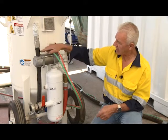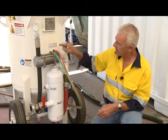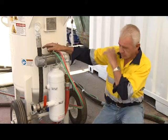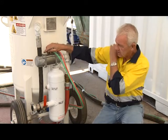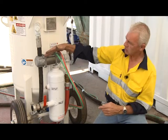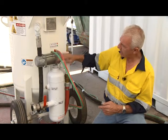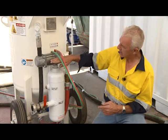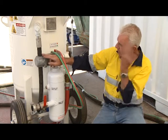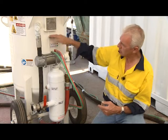There's a piece of plumbing hanging out the side and a hose coming down through this combo valve. That piece of hose actually pressurises the pot. The combo valve has a piston and a chisel in it. When you operate or open the dead man, the positive air uses a signal to send the piston back and pinch this hose. When it pinches the hose, the pot is now pressurised.